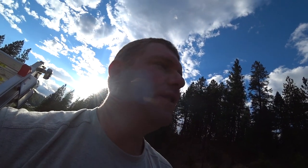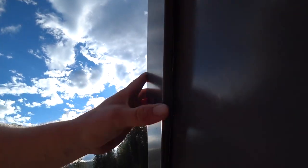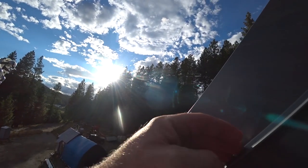So when you go to engage the hem on the cleat, you have no clue if it's working or not. So I put this on, slid it into place, and I can see that that's not even close to attached to that cleat. Part of it's because the cleat is practically facing down and this hem is way out. So like I said earlier, I don't know if it's worth fussing with this cleat even. A few fasteners on the fascia is not going to hurt anything. They'll have a really easy life and all they're doing is holding this piece of trim on.